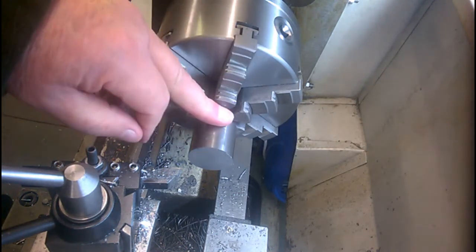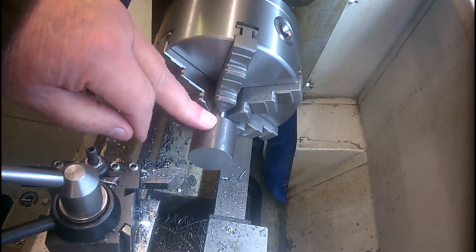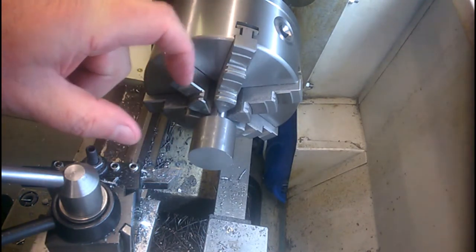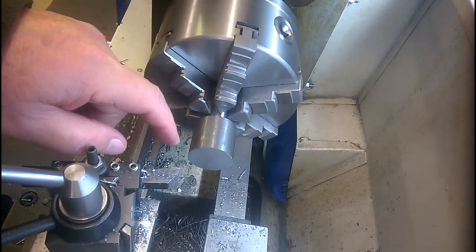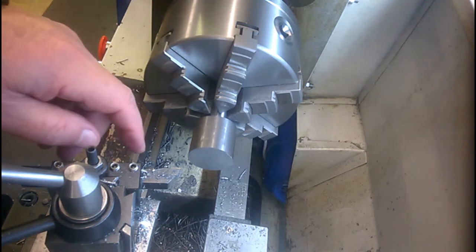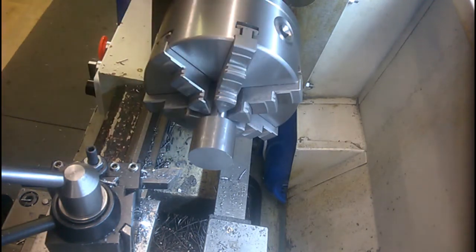Anyway, I've swapped the workpiece end for end. I was going to part it off, but it would have left me with a fairly sizable chunk. And why part it off when I've got a perfectly serviceable bandsaw? So I've bandsawed it off over length, and I'm now going to turn down the outer diameter